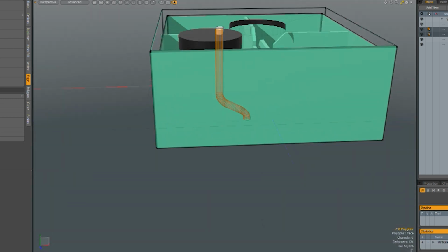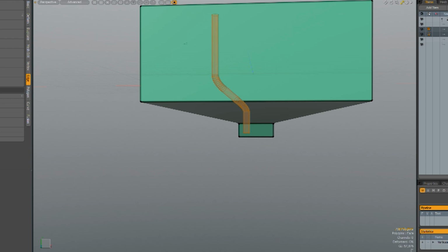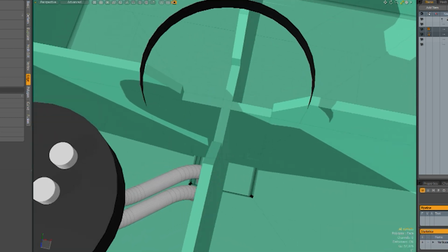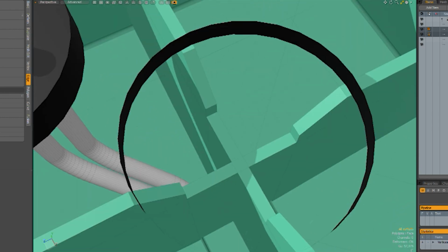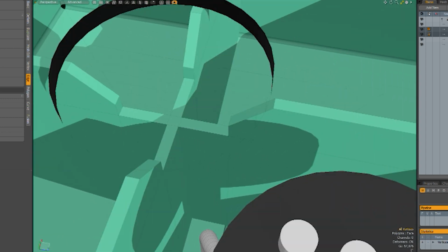However, you can switch a valve, and now you can pull from the sump if we want to run the fuel through our fuel polishing system so that we can suck as much of this crud out of the tank and get it cleaned out of there as possible. And this will cut down on the amount of times that we have to open this access hatch and clean these out. However, we can open the access hatch, and from that access hatch, we only need one because we can actually access any one of the four areas through here to reach in and clean it out.